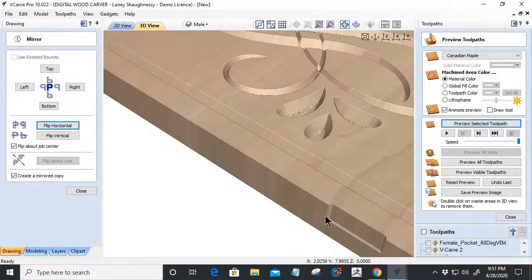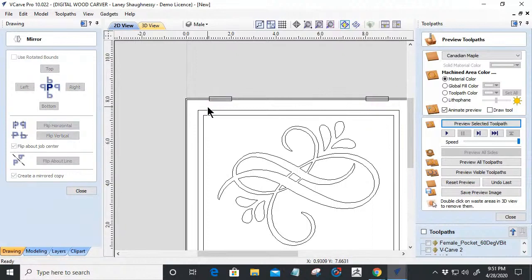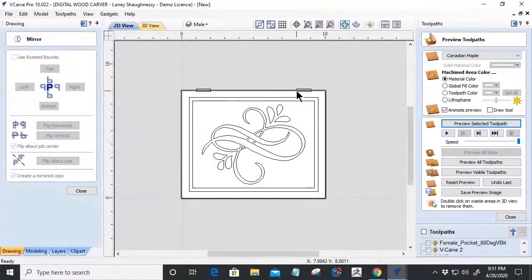But I want to go back and measure my hinge, make sure that half of the hinge, you know, how long it is and how wide that is, so I get that perfect fit, and I'll adjust my cut depth and my rectangle size here and all. But I've got that cutting those hinge mortises.